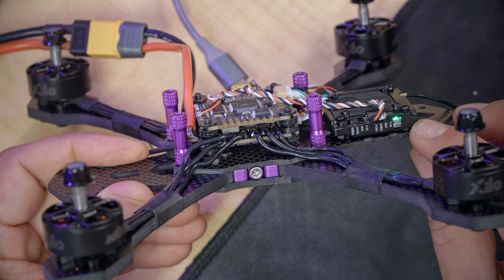It seems to me like the most precise placement of the camera relative to the front end is achieved by using the top screw hole of the camera moved to the top of this slit, which pushes the camera just a little further back. If you need to, though, you can slide the camera down a little bit in this slit, and that moves it forward a little. You can fine-tune that as you like. Only having one screw means that the camera may be slightly more likely to change angle in a crash, but if you tighten it down, it should hold in place pretty well. And it does mean that it's easier just to use your fingers to tweak it if you need to.